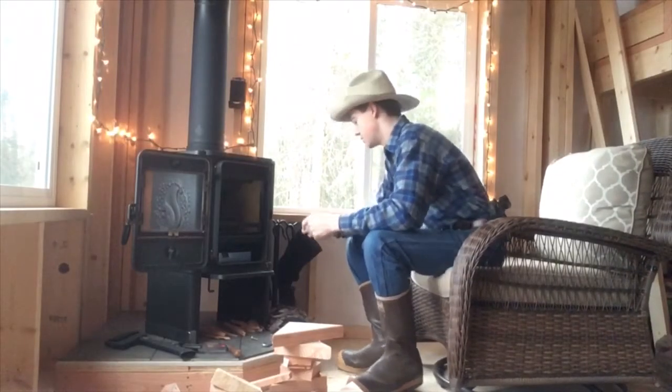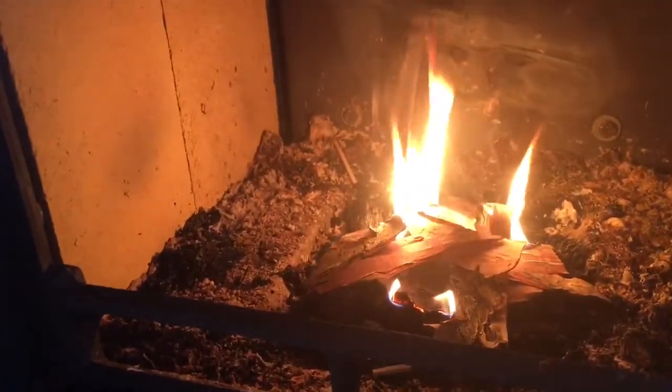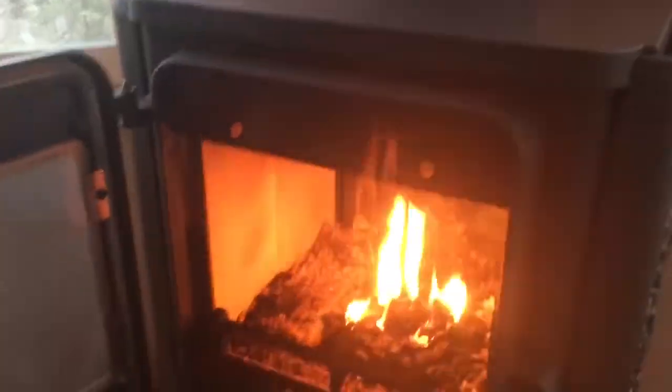I got some birch bark so before I do anything I'm going to heat up the flue. I'll just kind of put a little pile in there. You can see eventually it'll get all smoky in there and then once it really has nowhere to go it'll all start drafting up the chimney. You can tell when it starts, also by the air wash on the glass. When the draft is going right you should be able to have the door open and not have smoke coming out because it's all going up the chimney.